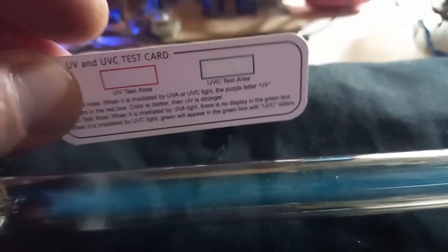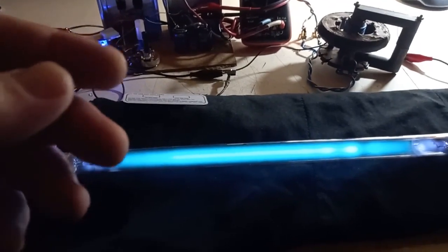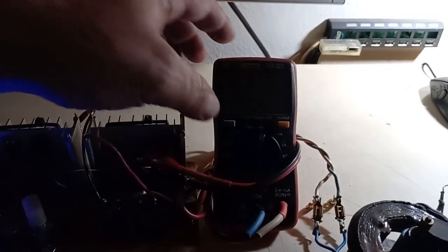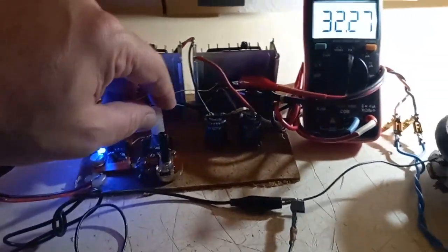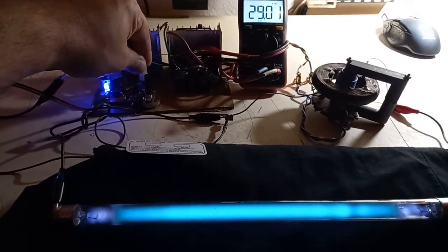The UV test area isn't really showing because power is too low. Let's turn on the energy supply. Now the tube is on. This isn't entirely safe since it emits UV-C rays and ozone, but at around 2 watts the power is so low it's essentially harmless. Let's adjust the fine frequency knob and watch both the frequency meter and the tube. It should land around 17-something kHz.